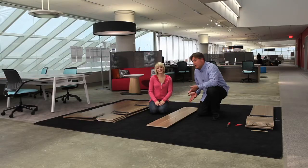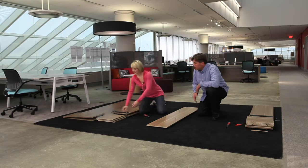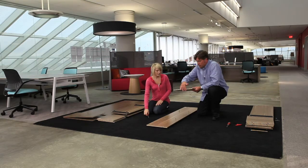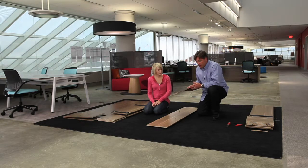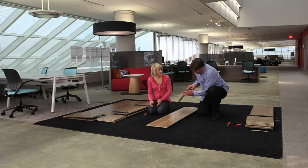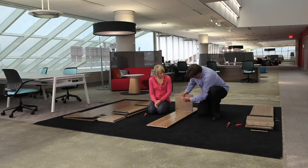We have all our connectors in and we're ready to put in the vertical dividers — two on this side, flip, two on the other side, then the end pieces, and we'll be ready to bring everything together. Something really important to notice: there are three unfinished edges on the divider and one finished edge. You align the finished edge on the divider with the horizontal piece — finished to finished — then click it into place and tighten it down.